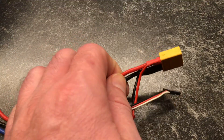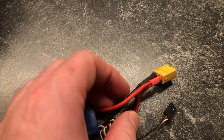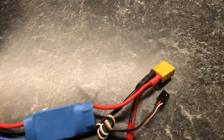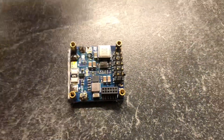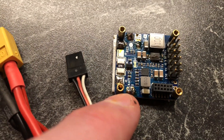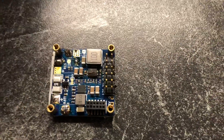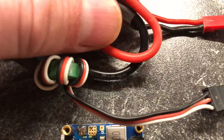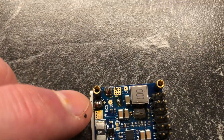Power is controlled by the flight computer, so you will have to connect it. When you cut this, you take your flight computer — this is the WSE — and the XT60 will be connected on those two: BAT PLUS and MINUS. Then what you have left over from the ESC, those two going to the ESC itself will have to be on those ESC pins there.